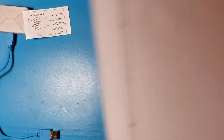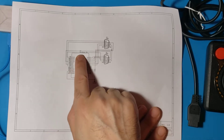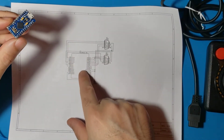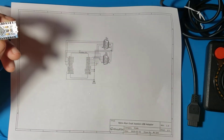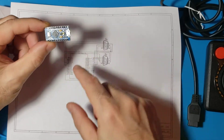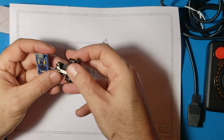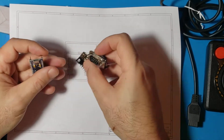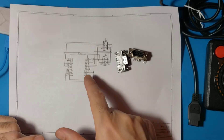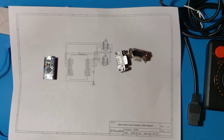So what I decided to do is use — this is a schematic diagram — you've got two of your ports here. I found a microcontroller which is a Pro Micro Mini; this is the 5-volt version that you should be looking for. It's got a whole bunch of ports. You need at least 10 ports on the microcontroller to support two joysticks, and I'll talk about how you can get beyond 10 ports using serial I2C communication. These are called DB9 male connectors. I drew up the circuit diagram — you can download it at the link below; it's also on my website, iCode.com. All the software you need to install on this microcontroller is also available on GitHub, with links on my website.